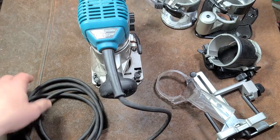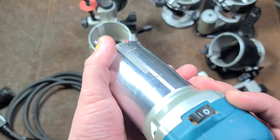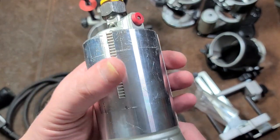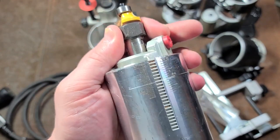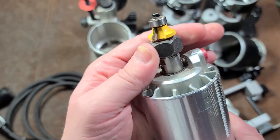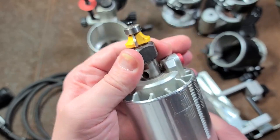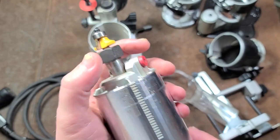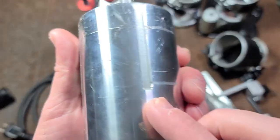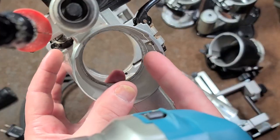Unfortunately it's Chinese made. I got this used at a Habitat for Humanity and it seems to work just fine — nice tight bearings. If you ever find any type of router, whether trim or full-size, you want to make sure there's no wobble on the spindle at all, and it doesn't pull in and out. If it does, it has bearing issues and you should pass on it. There's a little ding here which I can see happening when people are in a rush.